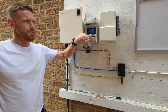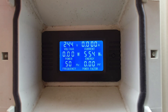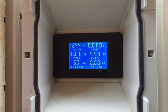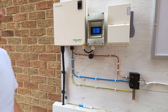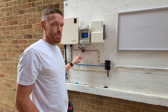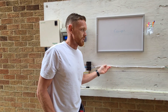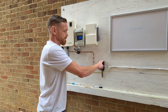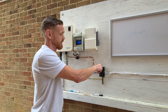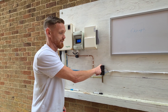We're running the 16mm live cable through a CT sensor, which gives us this little panel up here. That panel tells us exactly how many volts are coming into the system — currently 244 — the amperage running through the cable, the frequency, and the power factor. As electricity runs through the cable, the CT picks up the magnetic field and gives us a reading of exactly how much load is going through. We also have two Henley blocks here which can take 100 amps — named after William Thomas Henley from the 1800s.